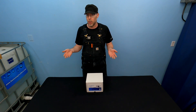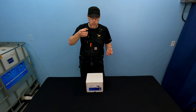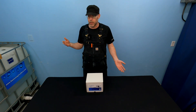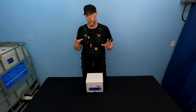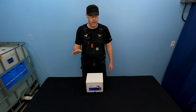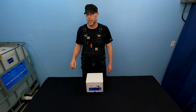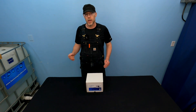Exactly the same thing that's in the back of your toilet tank — you set it for the water level. If the water level goes too low, the little styrofoam block drops down and it opens the water valve. As the water level rises back up, the styrofoam block floats and then it closes that float valve. They're very basic, not very expensive, and they work pretty good right until they don't. As a pool builder, it's something I noted — it's a great product to have, but they're not terribly reliable and they do break easily. Winterizing those old analog water fill units in cold climate areas is kind of a problem.